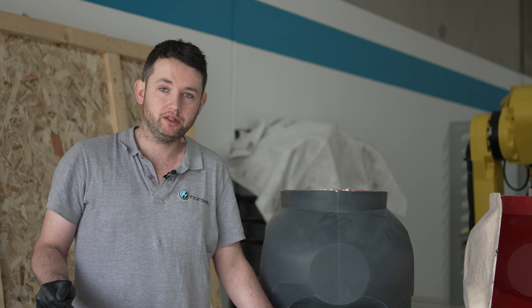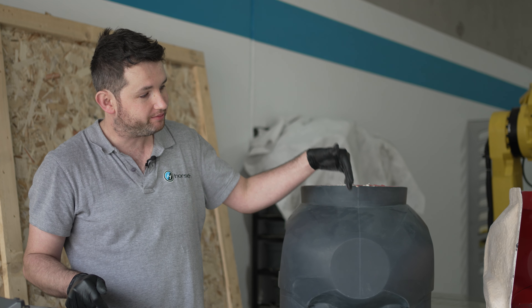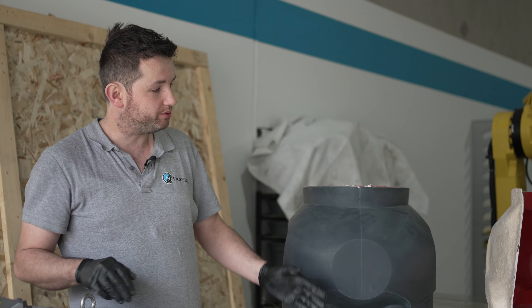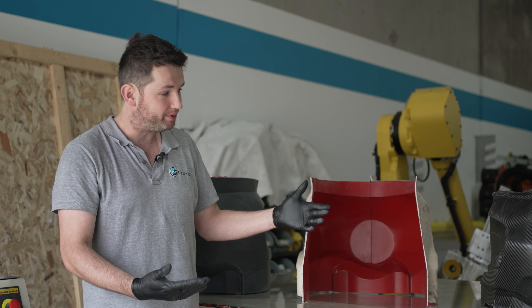As you saw in the previous video from Ka-Bar, they were machining all the plugs. We've got one of the plugs here finished, which is kind of how you get them, and from there you need to create the mould. You need to split the part because sometimes the part won't release in one go. As you can see, the mould comes in three pieces — one section down the bottom and two down the end. That's the only way the part is going to release. Then basically we lay up the piece and this is what we get at the end — one of the first pieces.